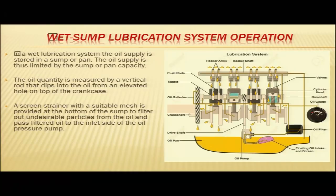A screen strainer with a suitable mesh is provided at the bottom of the sump to filter out undesirable particles from the oil and pass filtered oil to the inlet side of the oil pressure pump. So, in a wet sump lubrication system, you also have a screen strainer with a suitable mesh which is located at the bottom of the sump, and its purpose is to filter out all the undesirable particles from the oil and pass the filtered oil to the inlet side of the oil pressure pump. We will show you on the engine the drain plug, the screen strainers, the filler points, the dipsticks,